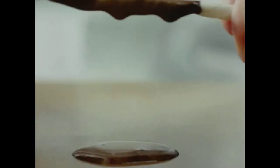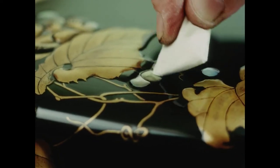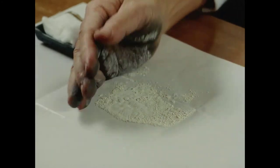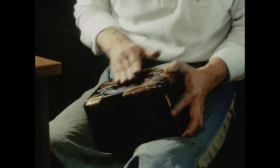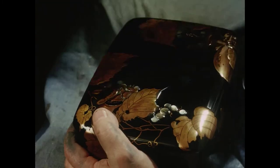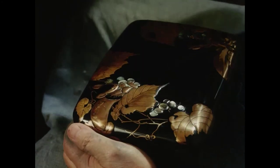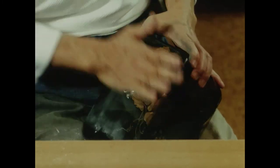He erases fine scars by smoothing the surface with powdered feldspar and a paste of clay powder and rapeseed oil. Nakano filters raw lacquer and applies it over the entire surface of the box. Now ready for the very last polish, he works the surface a little at a time with rapeseed oil and titanium powder, using his bare fingers and palms, as skin is more delicate than cotton or cloth.